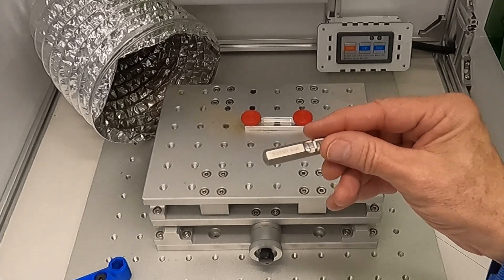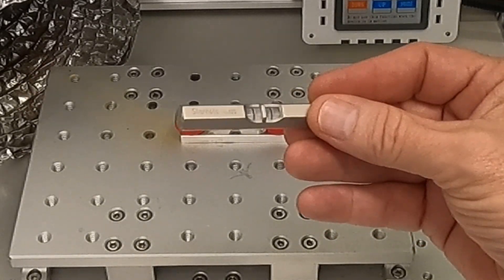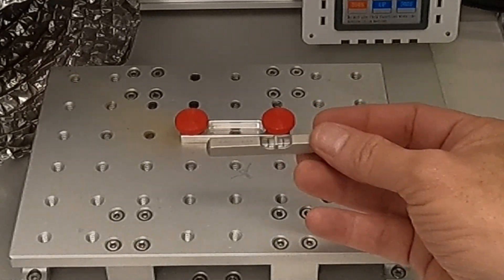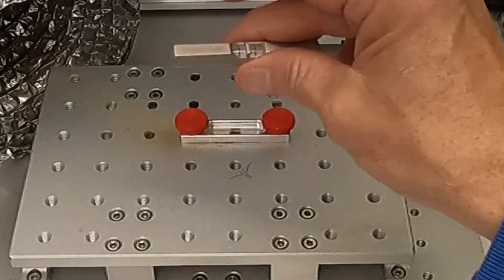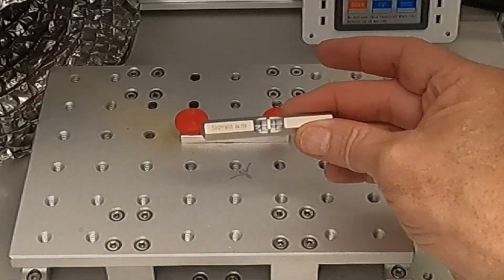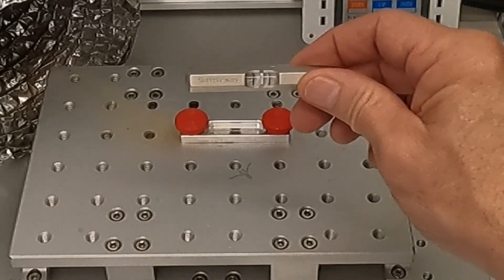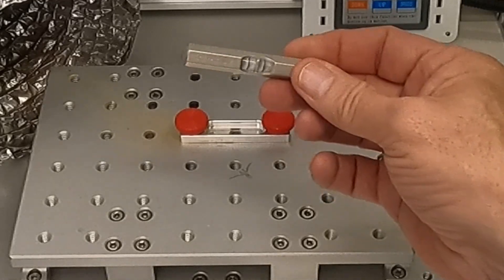The other thing right here is a Starrett number 135 level. It's fairly heavy, not cheap — about 30 dollars on Amazon — but when you're doing things for your fiber laser you have to make sure they're level. On a CO2 you make sure things are flat, but on a fiber laser you have to make sure they're level. This has nice level surfaces on different sides so you can put it on a knife blade or whatever to make sure it's level and you don't have any focus issues. Focus on a fiber laser is a lot more sensitive than on a CO2. It's very well built with smooth sides and very easy to use.